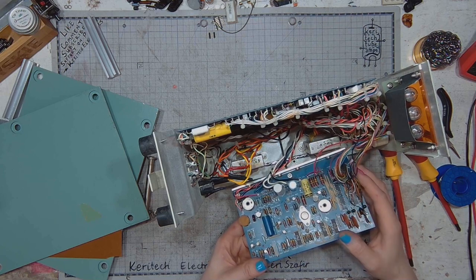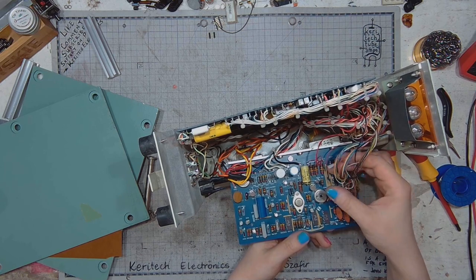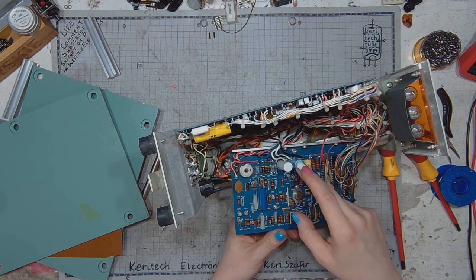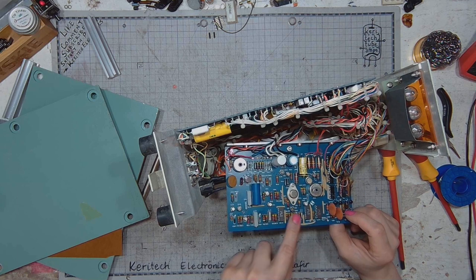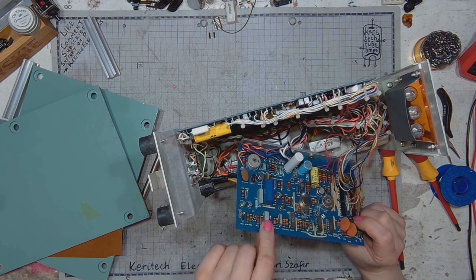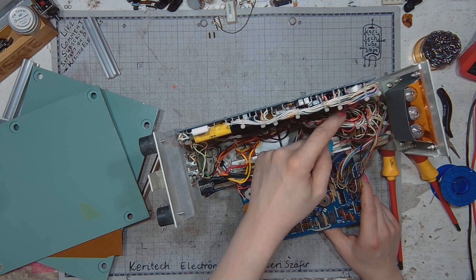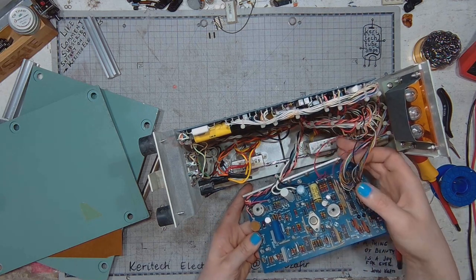It uses 141 Nixie drivers, a very typical Nixie tube control chip, and it uses 7490A decade counters, the TTL kind. It also has the high voltage power supply for the Nixies. Those are the plate resistors. It also has a bunch of other transistors and integrated circuits. It's got a multi-turn trimmer. Also another trimmer right here. This trimmer goes to the red, black and orange cable bundle. And we've got cable bundles going to the Nixie tubes.